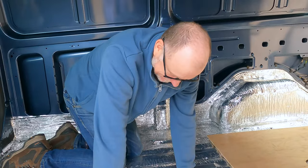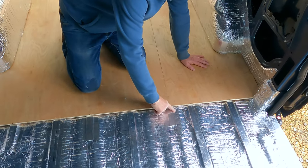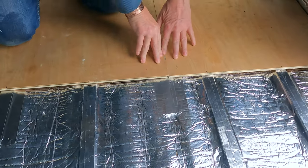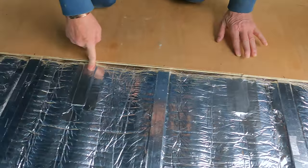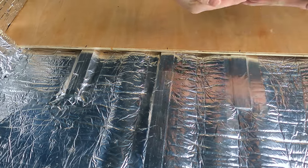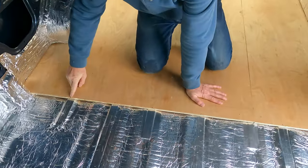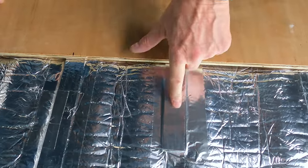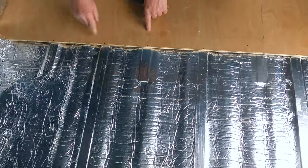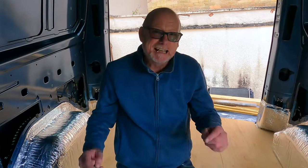Right, let's get that floor back down and screw it in place. Now that we've put these two pieces of floor in, you can see why we added those extra battens — this is the join for the two pieces right there. That piece of batten is now going to support these corners, which is really important. The two extra pieces are there to stop it sagging when we put weight on it. We've marked the batten positions with a marker pen so we know where to put our screws, ensuring they go into the battens. Let's get that last piece of flooring laid.